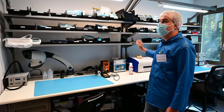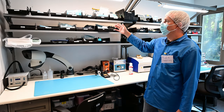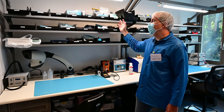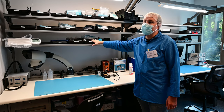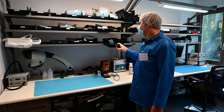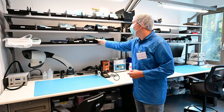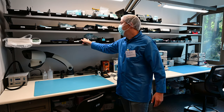Up here we've got all sorts of bins for storing assembly-related components. During electronics assembly this is for electronic components, and as we move into satellite assembly these shift to subsystems, cable assemblies, connectors, and similar items — quick and easy access storage for whatever you need at the workstation. The first shelf is a cleaning bin with q-tips, cotton and foam swabs, brushes, and isopropyl alcohol. We've got a PCB assembly bin with flux, solder, solder wick, and solder paste.